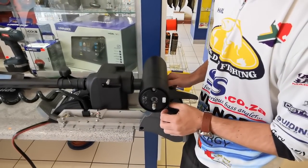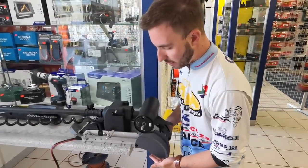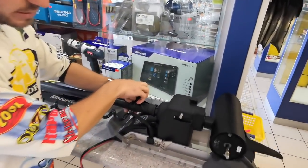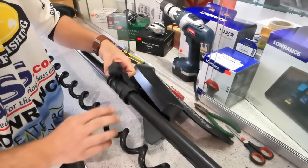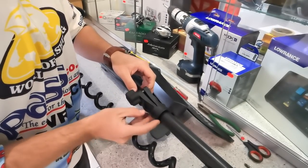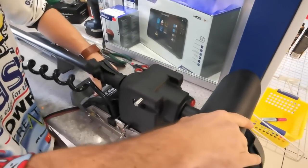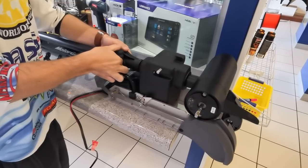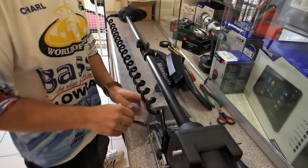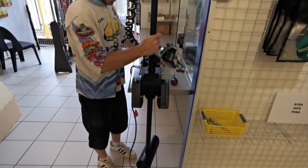When you are putting your boat on and off the trailer, you don't want to hit these. Just make sure the roller is not going to be able to take these off. If you look over here, this is your height adjustment that controls how high up or how deep the propeller sits in the water. An added benefit is you can tighten this up and it will prevent the motor from ever being able to be deployed or slipping down. To deploy the trolling motor, push that down, slide the motor forward, then down, and lock it in place.